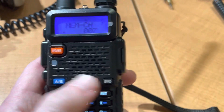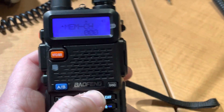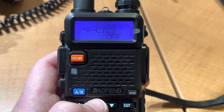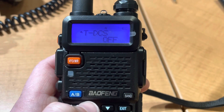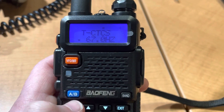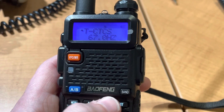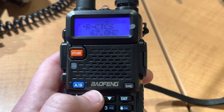6, 7. Now let's say you wanted to set a transmit CTCSS tone — I'm going to go back to settings 10, 11, 12, and 13. So to set a transmit CTCSS tone, you go to menu setting 13 and select the tone you'd like to set it to. And then if you want to have a receive tone, you do the same thing on RCTCSS, which is menu 11.